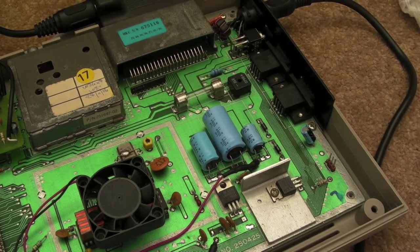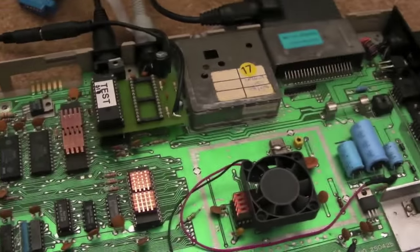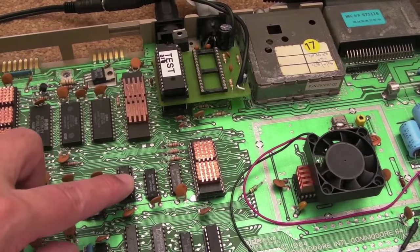It's blatantly obvious looking at the schematics — they're fantastic and it's really invaluable having those. I've spent quite some time just looking through all of it, seeing how it hangs together. I've learned an awful lot about the connectivity of various things, like even just the chip selects and how they're driven by the 139.